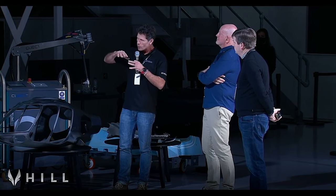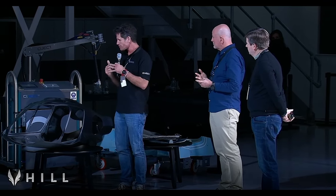But all those tools have to seal together with complete vacuum integrity, because this process that has been described, infusing liquid resin into this dry fabric, it's absolutely key that you get really good vacuum integrity. So we've got a vacuum seal that goes all the way around these tools that holds them together. And then we can confidently put a bag inside the tool that holds all the fabric in place, and all the preparation is done. All the carbon and some of the consumables are in place. It's quite a complicated shape, as you can see. And then when we've got that vacuum integrity, the resin will fly in, as Tim said, in about 20 minutes.